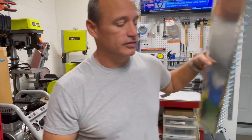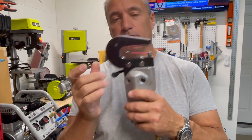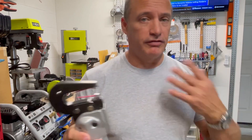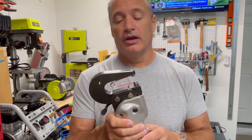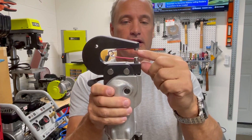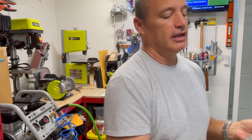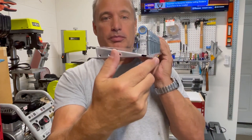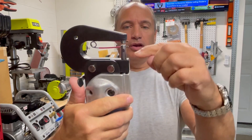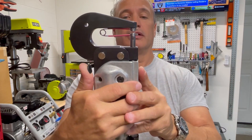There is a dimple die set that's specifically made for the elevator on the RV14 - it's the only thing it's used for. I went ahead and bought it, not knowing if I'd want to use it. It turns out when I did the rudder, I didn't have any problem setting the rivets the way it's described in the instructions. But I had already bought it anyway, so I'm going to try it out. The way these are set up, there's actually about a four degree slope on each one of these, which pretty much matches the slope that happens on the back of the trailing edge. So the idea is when you squeeze this down, you end up with exactly the same angle as that surface, which makes the process go a little bit faster and easier. But after having done the rudder, I don't think it's necessary - since I've got it, I'll go ahead and use it and we'll see how it does.